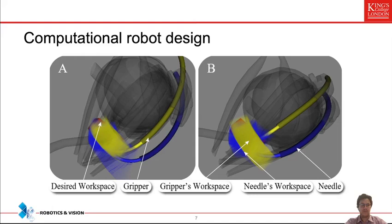You want increased reachability — a 3D requirement — which can be assessed by voxelizing the workspace and ensuring the robot reaches all voxels. But you also need increased dexterity. To evaluate dexterity, we developed a new process to voxelize SO3, the orientation space. By voxelizing 3D space with classical discretization combined with SO3 discretization, you obtain a way to discretize the entire set of robot poses and incorporate this into computational design frameworks to maximize both reachability and dexterity, while following the curvature of the eye and avoiding muscles.